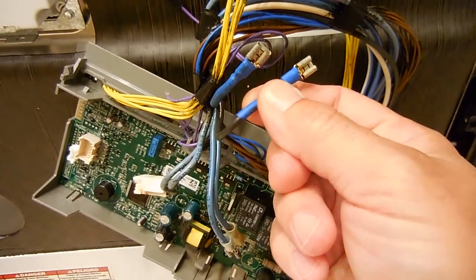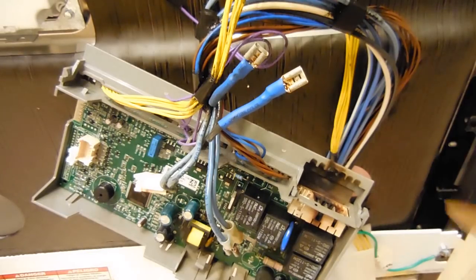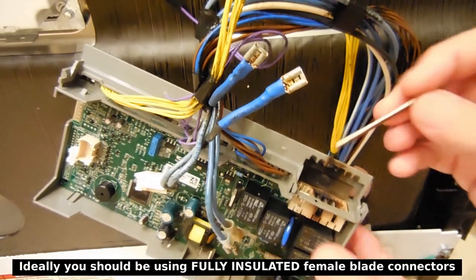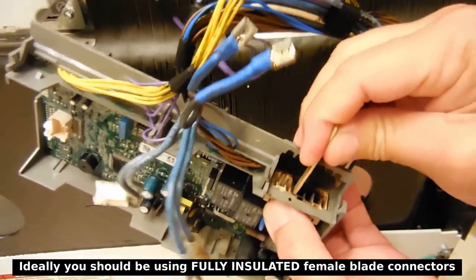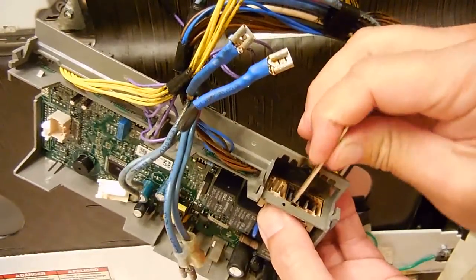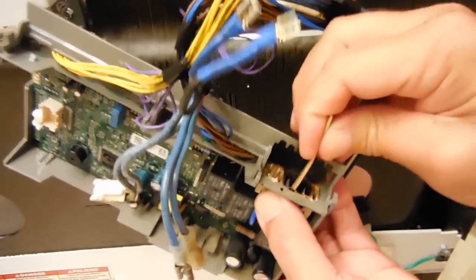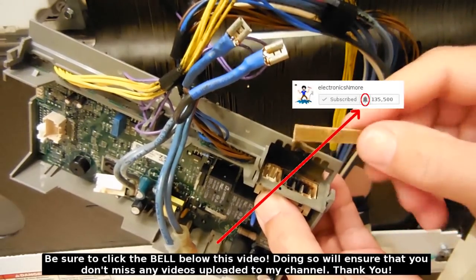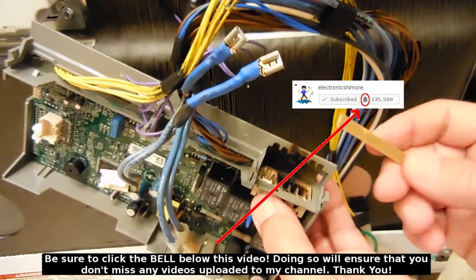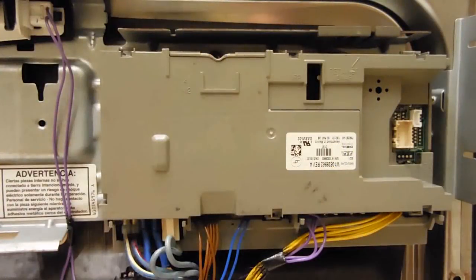You can see right here the black wire is now soldered and heat shrunk, and the same for the white — the neutral. Now I'm going to take the nail file that I cut and go into each one of these connectors just like this. You want to get both sides, go over it several times, and blow out any sand or grit from the abrasive paper. When that's done, I'm going to plug everything back in and we're going to give it a try.